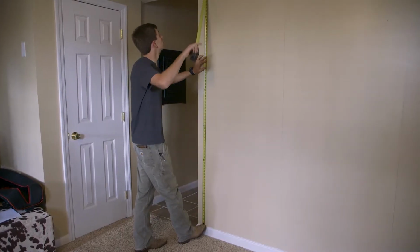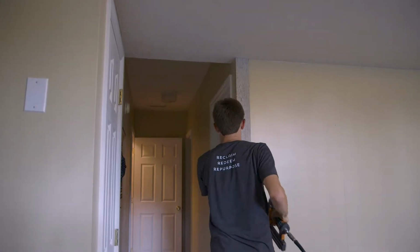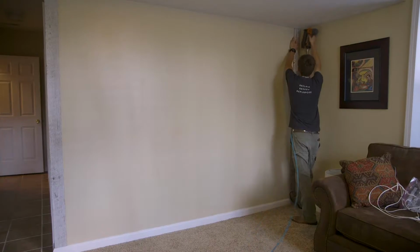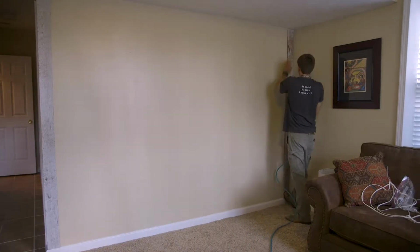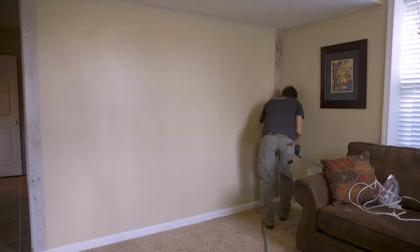If your wall has an outside corner, we recommend installing a vertical trim board to hide the edges of your horizontal boards. You may also choose to install a trim board on the perimeter of your wall to frame in your horizontal paneling. If you decide to install a trim board, make sure to install this piece first so that you know where to end each horizontal run.